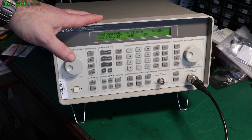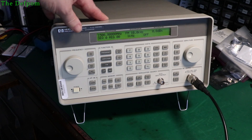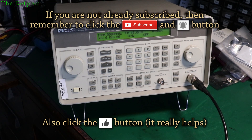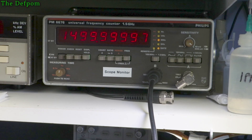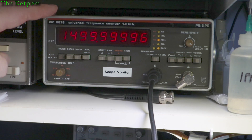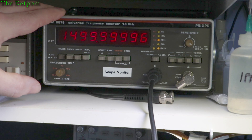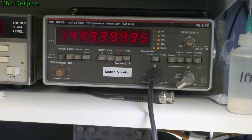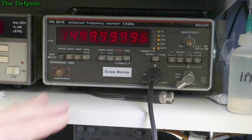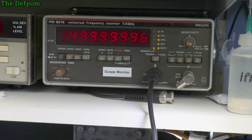This unit is currently slightly off frequency. I've got my rubidium plugged into the back as a good time base, and I'm running into my 1.5 GHz frequency counter. The Philips frequency counter is showing the frequency with the rubidium plugged in — it's about 30 or 40 hertz out at that frequency, so only a very small amount. I know with the signal generator running off rubidium the output is accurate, so this is the frequency I should be trying to achieve on the HP during calibration. The calibration spec says 100 MHz so I'll probably change to that.